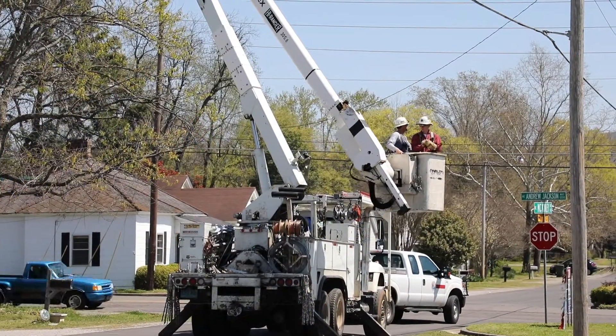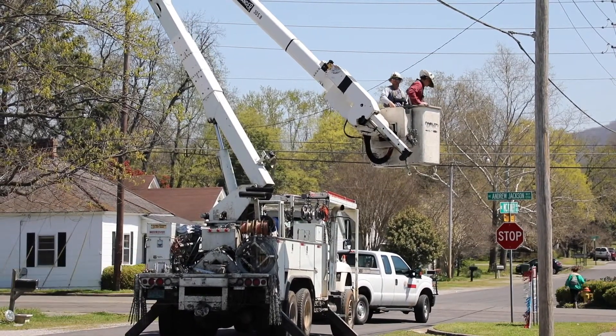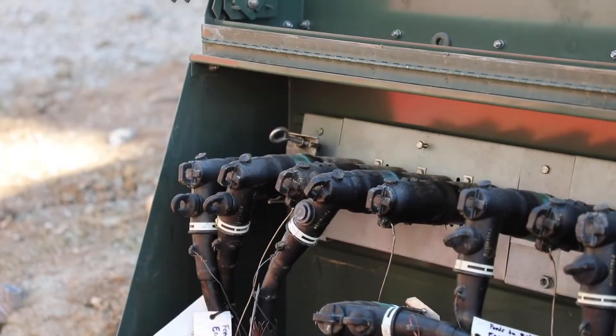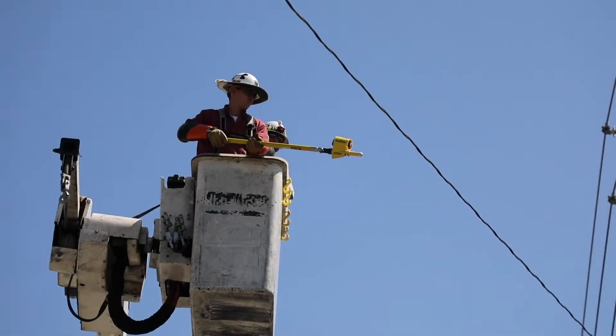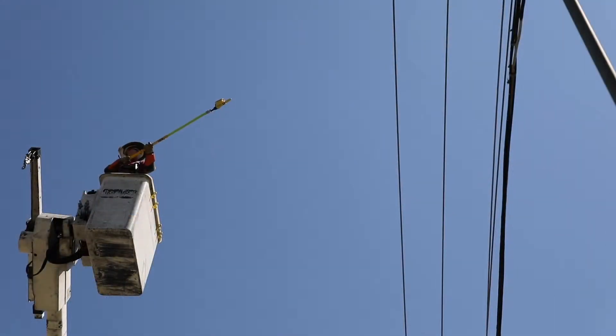I will try to show you a lot of different situations where you might use this meter so that you can be familiar with how it will respond in your situation. For example, insulated underground lines will be more difficult to pick up in proximity mode due to the amount of insulation around the lines. With overhead lines or uninsulated wires, the proximity detects energy at a much further distance.